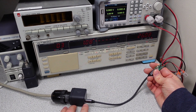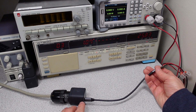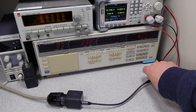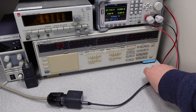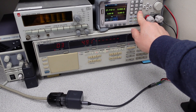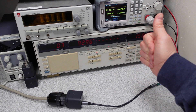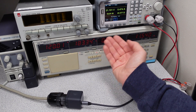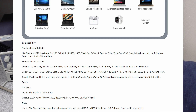I have my decoy board set up and we can push the button to check the different voltages it can provide. We're looking for 5 volts, 9 volts, 15 volts, 20 volts, and a 21 volt PPS mode. You can see the THD number popped up just from changing to the different modes. The different voltage modes are useful because there are different standards for charging your devices — specifically the PPS mode and the Power Delivery 3.0 modes. It does skip 12 volts, which is optional.